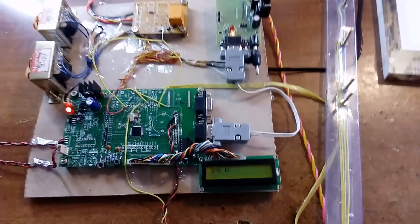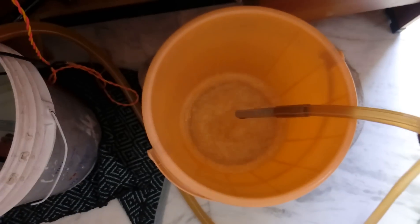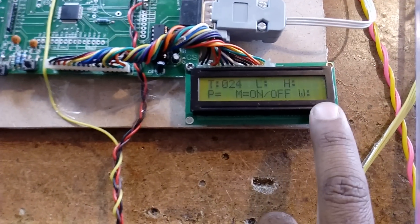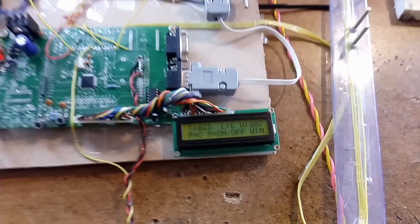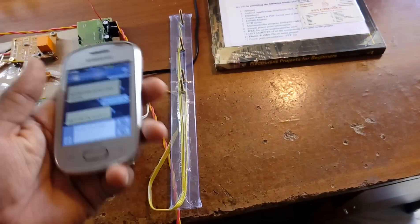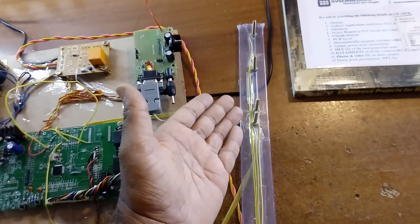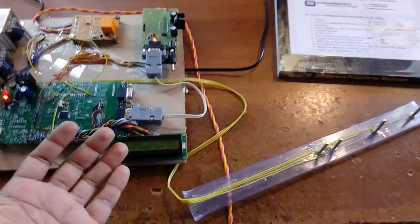The system sends an SMS: 'Motor on, water on.' Water is coming in and the W level is increasing. Now it shows full — water has reached full level. As the groundwater decreases, the status shows medium, meaning water came to the middle. There is no SMS at medium level. If the water goes empty the system alerts 'water going empty.' The owner can also send 'motor off' to stop the motor. When groundwater is empty the system tells the owner 'your water will be filled — please turn off the motor.'